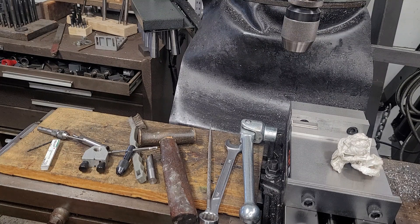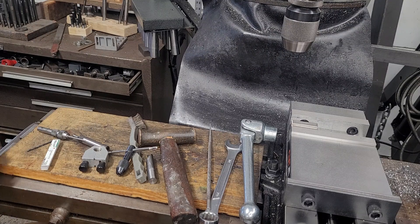Another really important thing is to not disturb your setup. Once you've drilled that hole, if you're doing this sequentially, don't move the machine around more than you absolutely have to. I use the knee to crank the machine up and down so I'm not moving the table, even though I do have a DRO. I also don't use the quill too much — I like to have everything sucked up tight, because for me it just makes it a more comfortable height to work at. I'm 6'4", so most Bridgeports are fairly low for me once you put a drill chuck and tap follower in them.